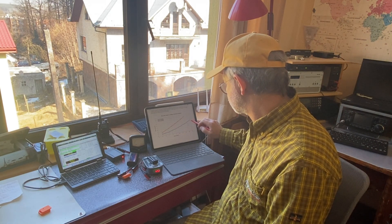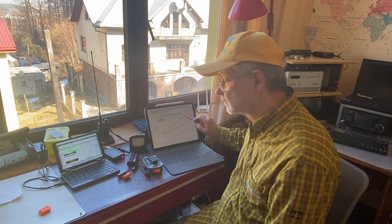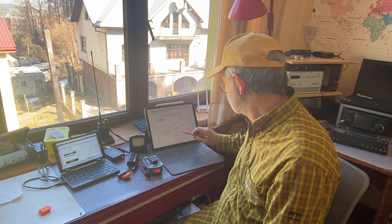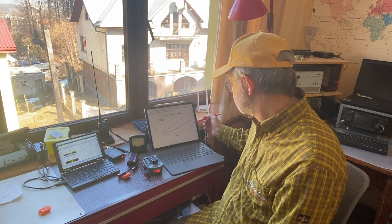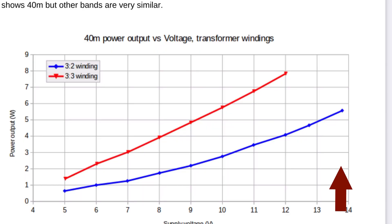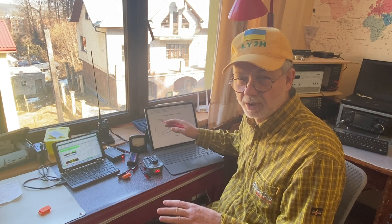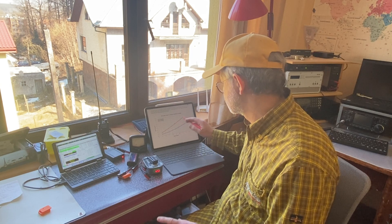Let's take a look at the QRP Labs chart showing the transceiver's power output. The blue line shows the 12-volt power supply and the red line shows the 9-volt power supply. If you run the transceiver at 13.8 volts, you're getting more than 5 watts — actually a solid 5 watts. That's fine if your purpose is to always operate from your shack using a fixed 13.8-volt supply.